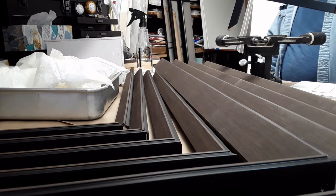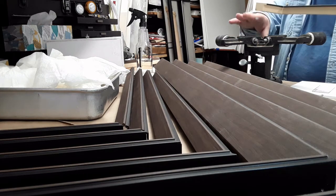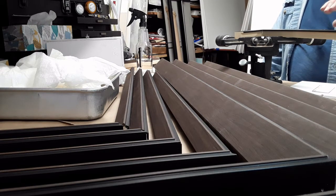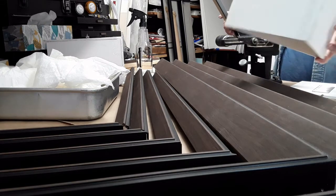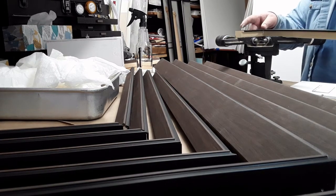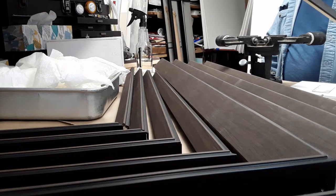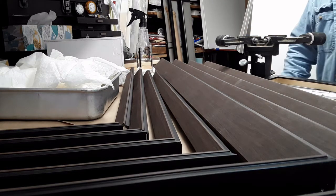After the joints are nailed, we do a whole bunch of halves and I like to set them up overnight, then do the other halves together — especially for great big frames. With big frames I'll sometimes set up four vises and do all four corners at once. A lot of times when doing just half the frame I'll use little boxes I made to help hold the other end. If you're working with a huge heavy frame you don't want it to be hard to deal with, so a little box lines it up nicely.